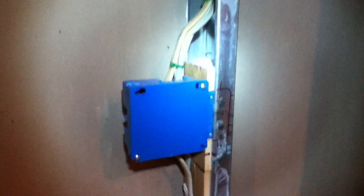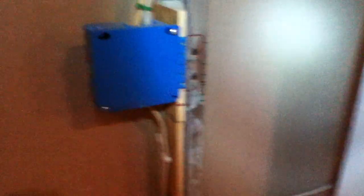This is just a J-box, tying some of the wiring. This is where the main power comes in and gets split off for the lighting circuit inside this J-box here. Down here is where it comes in and goes through the other studs. This is protected there by the drywall. There's a bushing — a plastic bushing on the metal stud — as it goes through.